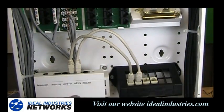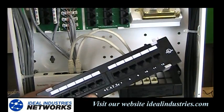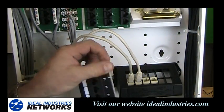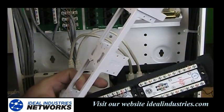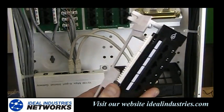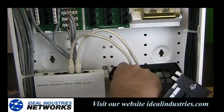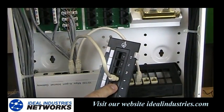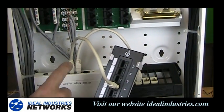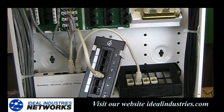Another option for data would be not to mount these devices or put a panel in. We could simply mount a patch block somewhere in the house — on a wall or really anywhere. When we take this apart, the two parts separate, and the bracket can be mounted on a wall. We take Cat 5 cable and punch it down in the back, then mount it on a wall with a router or switch nearby, and jump from the patch block into the router or switch to put data to a particular outlet inside a room.